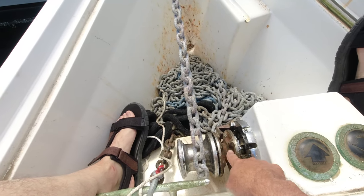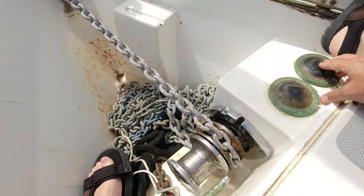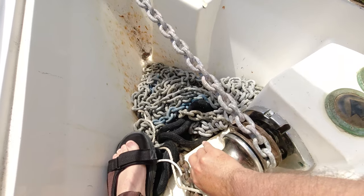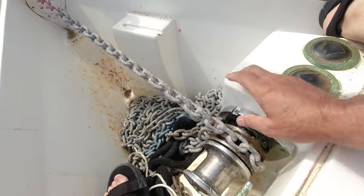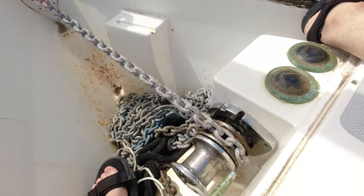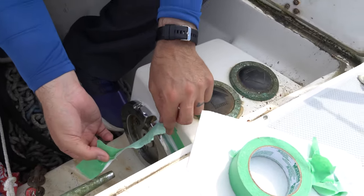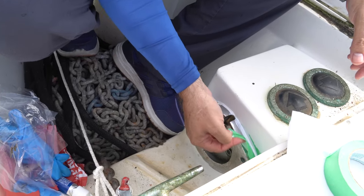I lowered the chain into the water and you can see what happened immediately — the chain jumped out of the chain wheel and fell onto the pulley, and fortunately jammed up before the anchor went too far into the water. I put the chain back onto the chain wheel and tried to retrieve, but it's just slipping — partly because I can't tighten up the clutch cones nearly enough. So that's our cautionary tale. If we had checked the windlass operation at first, we would have immediately discovered the problem — that the size of the chain didn't match the size of the chain wheel on our aging windlass. We could have done exactly what I've just done: order a new windlass. We actually want to keep the 3/8ths chain — that's about $1,500 worth of chain — and a new windlass will be about $2,000.